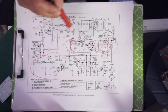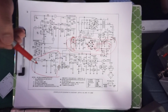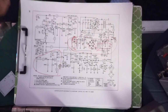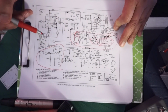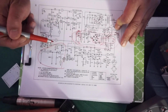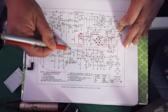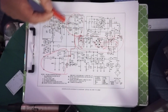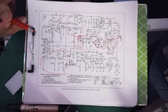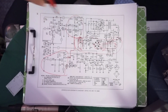And the power supply is really important, because the power supply is what powers this gain stage. Let's follow the gain stage. Let's say we only had a preamp, or we had the Epoch Pre. It would hit the preamp, and then it's going to go up. I'm looking at the schematic upside down, so a little difficult. The signal comes out here, and it goes up here into the mixer stage. The mixer stage is a resistive mixer stage, and that's what's going on in the Deluxe as well. And on the Epoch Pre,